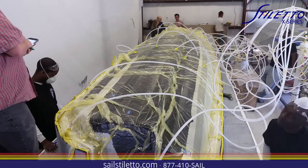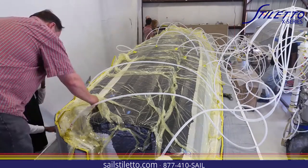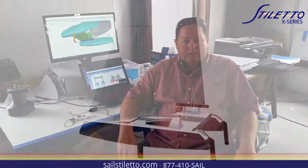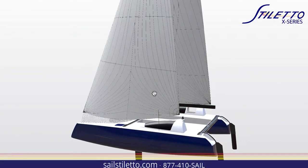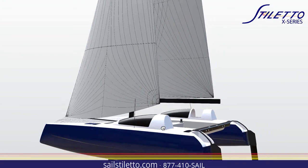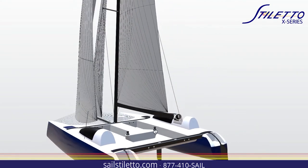A resin-rich mould is what we want, as opposed to how we build our parts. When we build our parts out of that mould, the parts will be made with prepreg carbon fibre for the foiler and prepreg epoxy for the X and XC. The prepreg is where the cloth comes to us with the resin already in the cloth.